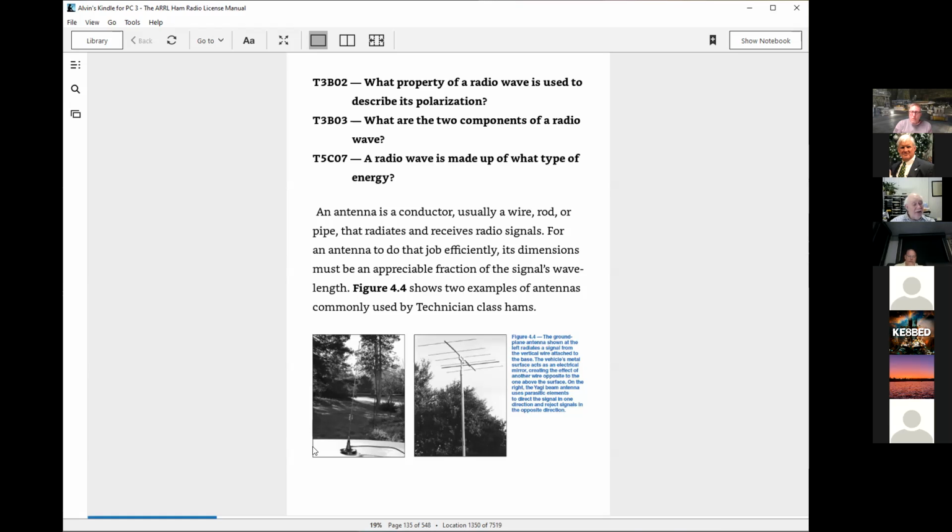And if you have a vertical antenna and you have 3 elements spouting out of it, that would cause a counterpoise. What is it? Our old middle school trigonometry. How many points do you need to create a plane? Yes, 3. Actually, I had to take geometry over again. Anyway, 1 is a point, 2 is a line, 3 is a plane. Right. So that's why these are called ground plane antennas, because it uses an artificial plane to act as the ground.